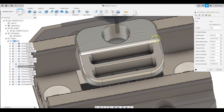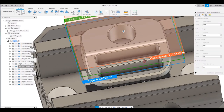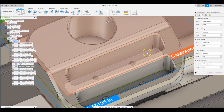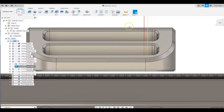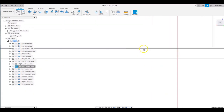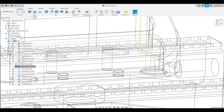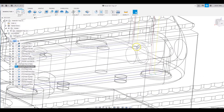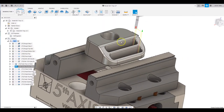The other thing I want to look at real quick is my finish height. My finish height is the bottom of my selected contour. I actually want to try to pick that up even a couple of tenths just to keep it off the floor. So I'm going to pick that up three tenths. That'll keep it three tenths off the floor of those pockets. It won't be noticeable to the naked eye, but that keeps the cutter from being engaged on both the floor and the side walls at the same time. Even though we've already finished the floor, it would still tend to drag across there and could affect surface finish.